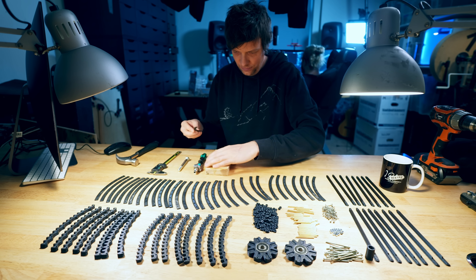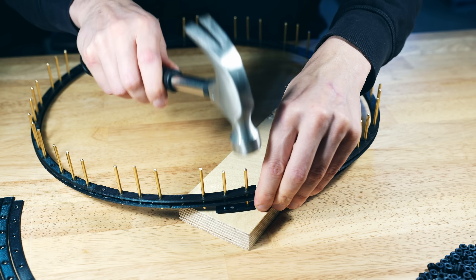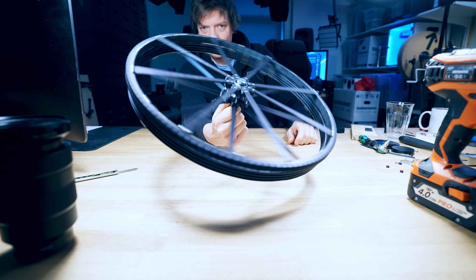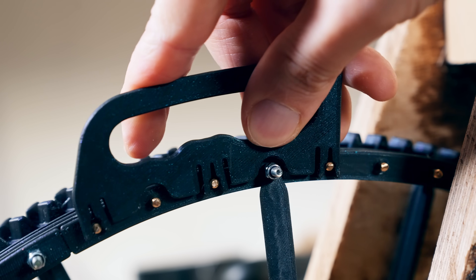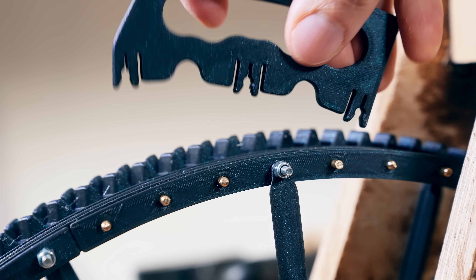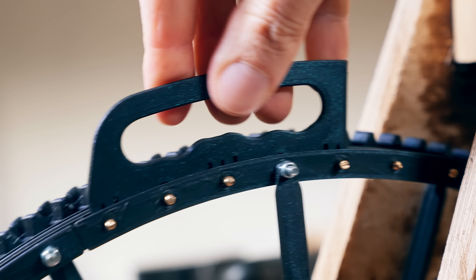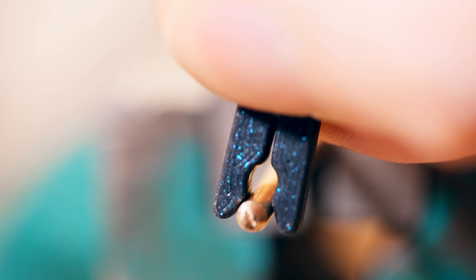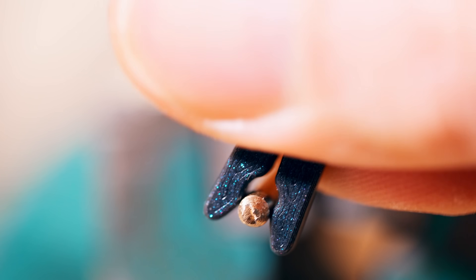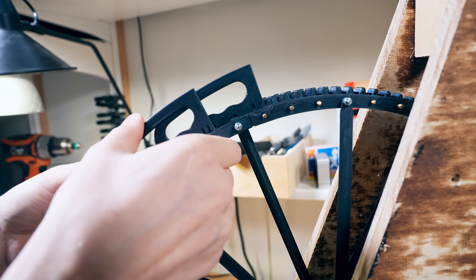The main idea for version 2 is to use a lot of two-dimensional segments to build a very accurate 3D cylinder using metal bars and press fits. Instead of making a hole for the programming profile to click into, the profile clicks onto the metal bars. This has serious advantages: the plastic of the profiles is softer than the metal of the bar, so over heavy use the profiles would wear out before the programming wheel does. We no longer need to machine 2,000 perfect holes — the metal bar is just perfect to begin with — and we don't have to worry about hole tolerance for music timing.